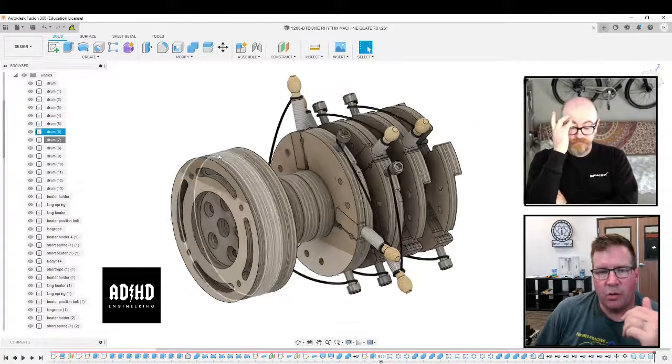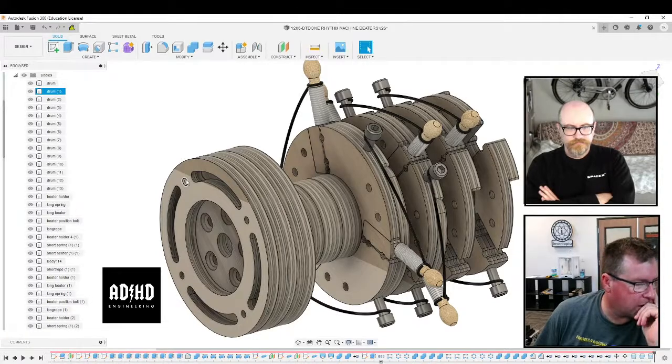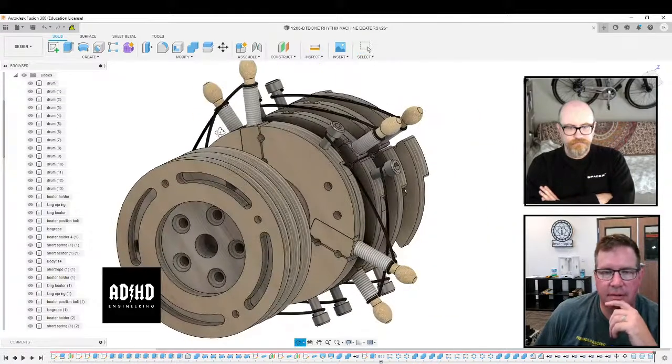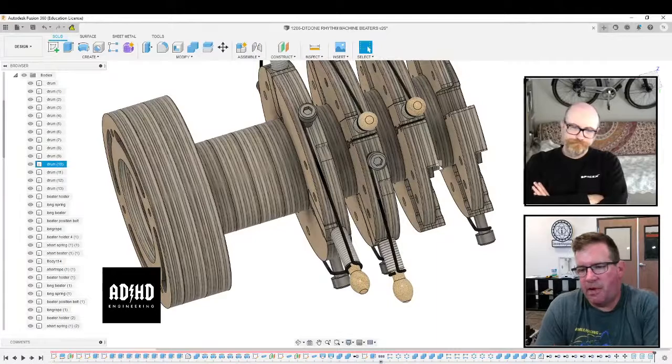Yeah. And so we would open up this assembly. We would save it. This is 1206, right? We would save it over there, and we would make the parts. We can have SolidWorks set up to automatically assign part numbers to each part, and we don't even worry about it. And that's it. Jeez, I didn't even know that. Yep. That's through the SolidWorks Connected thing. You can have part number assignment standards. I don't use that myself. So yeah, I think that's going to be the workflow, David.